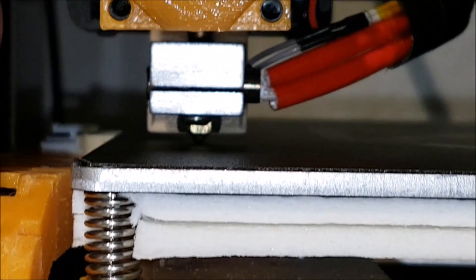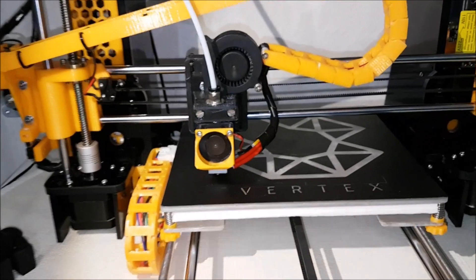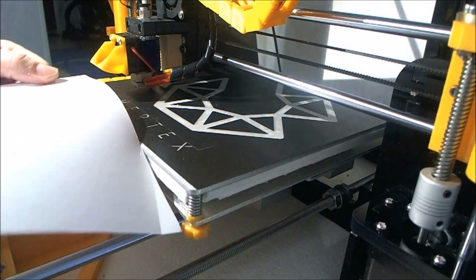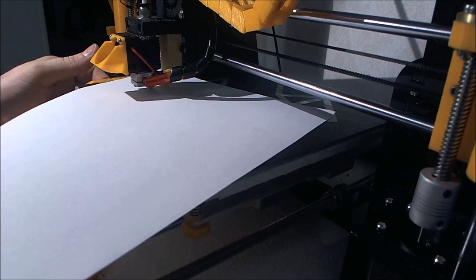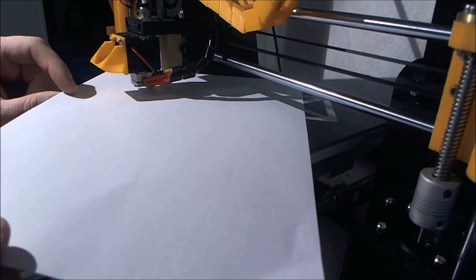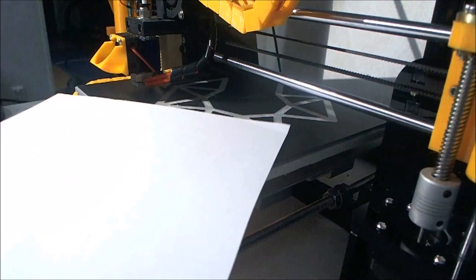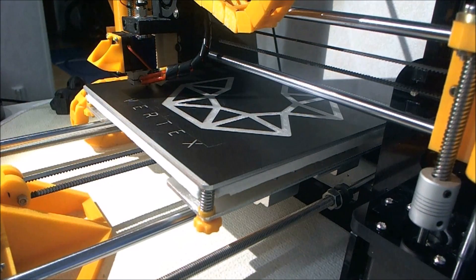Take your A4 paper and put it right underneath the nozzle. The idea is that the paper should not be stuck completely — there should be a gap of at least 0.2 mm. The paper thickness of about 0.3 mm can work, but the point is the nozzle should not hit the bed. Find four spots on your bed to check. It's a little annoying to work around the printer, but let's do it with the printer on to avoid confusion.